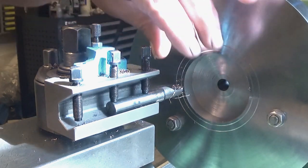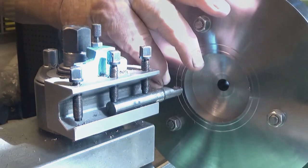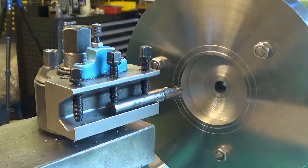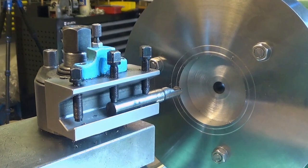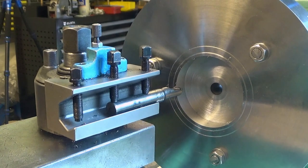Okay, that was the last millimeter from the diameter rough cutting. So okay, the insert is now turned. I have also slowed down the feed. What I'm doing now, I have not touched the dials here. I will do a spring pass here, and it should clean up the surface really nicely now. So let's see.